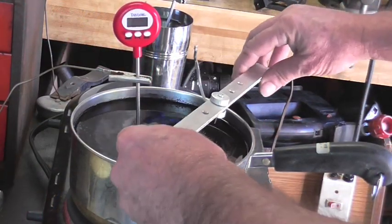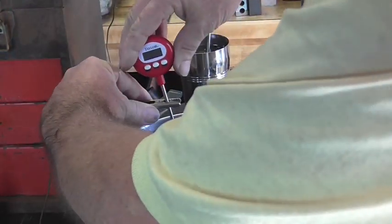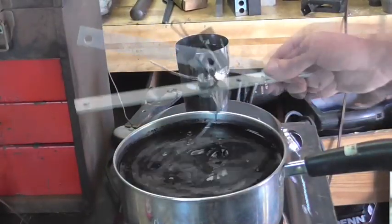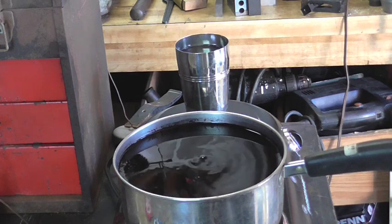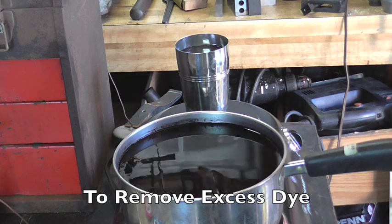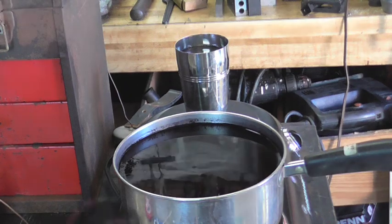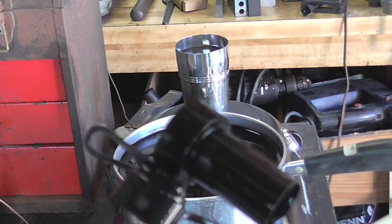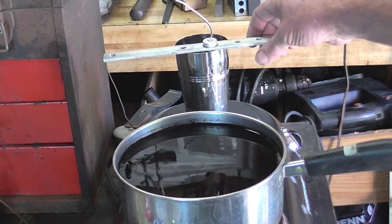It's been in here about 9 minutes — let's take a look at it. It's taking on a nice black color. Our 20 minutes is up, so I'm going to go ahead and take this out. And that's looking pretty righteous. What we want to do is go ahead and rinse it again with distilled water. You're going to see some of that dye coming off — it's nothing to be alarmed about. So here's the anodized and dyed part. Now we're going to go ahead and seal those pores by dropping it into 180 degree water.